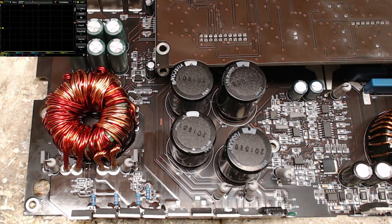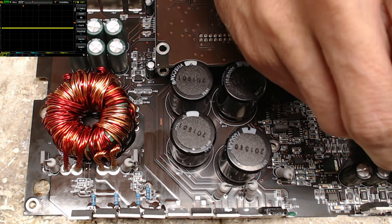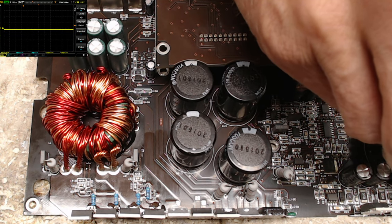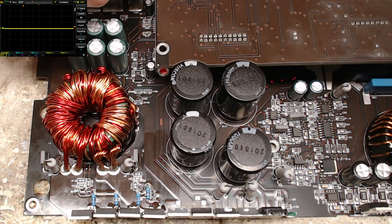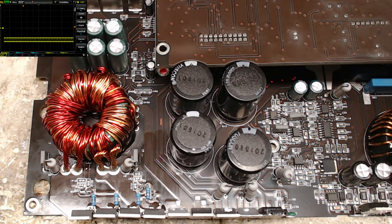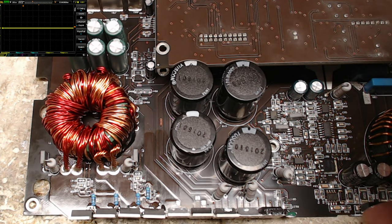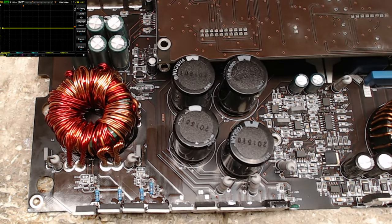The LED is underneath, so I really can't see what's going on down below. And we do have, it goes to negative rail pretty quick. Let me get this focused. Let me get the voltage settings right on this. Pretty sure that I'm going to need to be able to see the low side drive. Yep. All right. And I did that just really quick because, again, you don't want thermal runaway. You'll never know without using a thermal camera if you don't have thermal runaway.